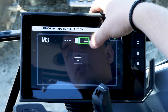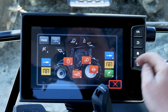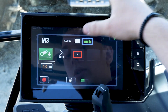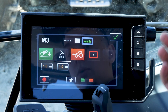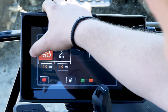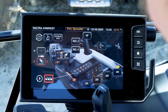For U-pilot, if we switch to the side we can select the positions we want to use. For example, we put the rear implement into the working position, then we want the auto guide, and after that we want the four-wheel drive to be activated. Now we have our U-pilot set. If we drive the first line and see it's in the wrong position — for example, four-wheel drive should be first — we tip and swipe and now it's in the right position. With the arrow we confirm, and our U-pilot is now saved to the M3 button.